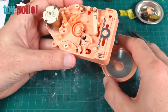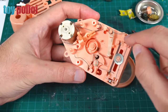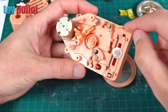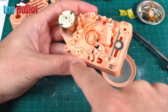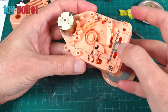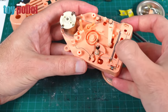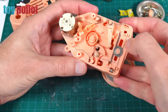It looks fairly simple. What is missing is that contact here that was handmade needs to be replaced, because there's a wire that used to be soldered to whatever that contact was. We've got a circuit where the electricity goes all the way around through the motor at the end, round back to the other end of the battery. There's this little thing that moves left and right - I think that will control the speed of this motor, because there is a very long coiled bit of wire. The more length of wire the electricity has to go through, the slower the motor will go.